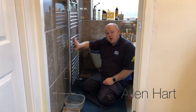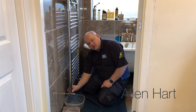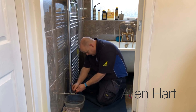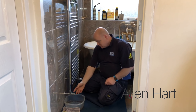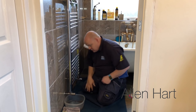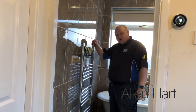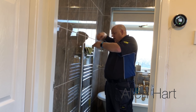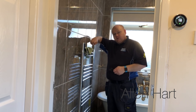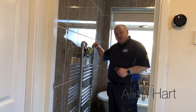We've removed enough water out of the radiator now, so I'm going to connect the valve back on at the bottom of the radiator - we just need to tighten this back on. What we don't want to happen is we pour the inhibitor in the top and then it comes down and out of the bottom. So that's all tightened back on now. I'm going to open the air vent at the top and then close the bleed point just so I don't forget it later. I'm going to remove the full bleed point at the top - you could take the blanking cap out as well - and we're just going to use this hole to put the chemicals in.